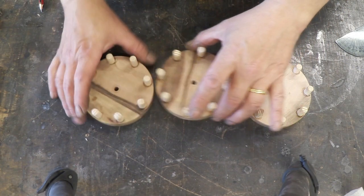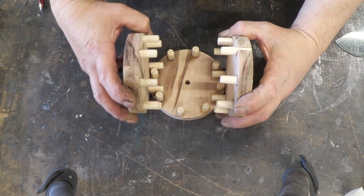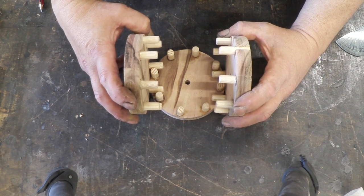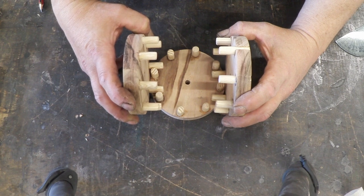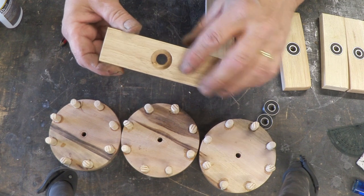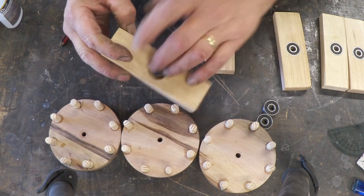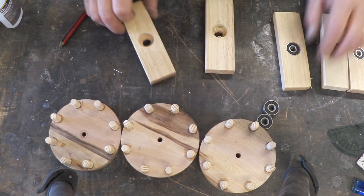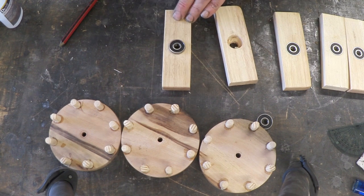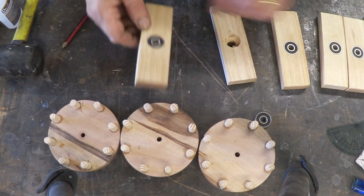And there's the three gears complete. They engage like this: as the bottom one turns, the two upright ones turn in different directions. What we need now is to make a cradle to hold that all in relation. I've drilled a 22mm hole not all the way through, with a 12mm hole inside it — I drilled the 22mm first and then the 12mm — because I want these things to have bearings. You just pop a bearing in there and then it won't foul the axle but it won't drop out either. You do that to all six of them, and that's what forms the cradle.